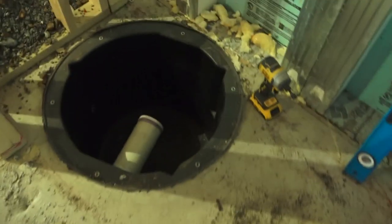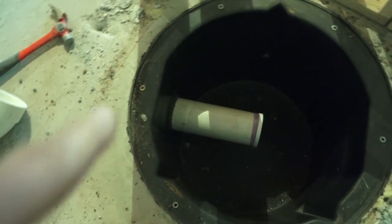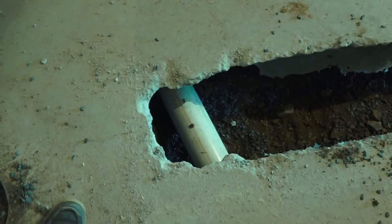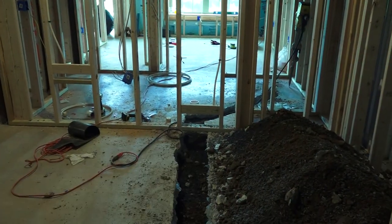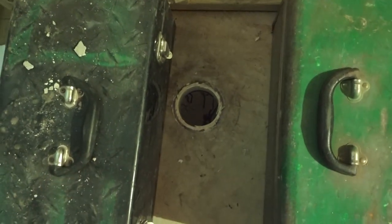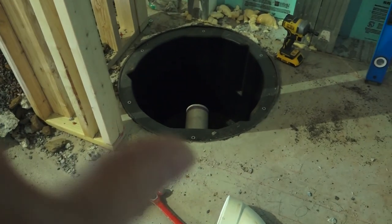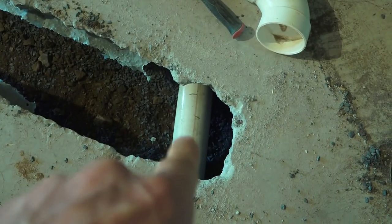Back over here looking at the original pit, you can see we've got the lid off now. There's a big old four-inch pipe coming through there, put in by the builder, passing underneath the floor. Here you can see where we jacked the floor open. The bathroom's way over yonder and we had to jack across the floor — about 13 to 14 feet — until we found that four-inch pipe. That four-inch pipe went across and tied into the toilet over here. That was the original toilet location right there. So it goes down into the floor, passes underneath the concrete, shows up right over here, and travels straight over and into the pit.